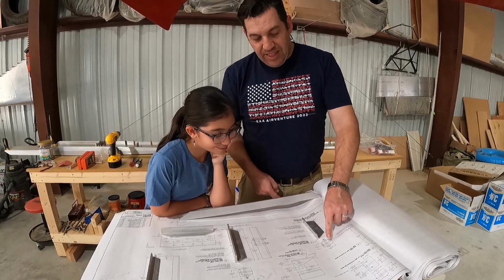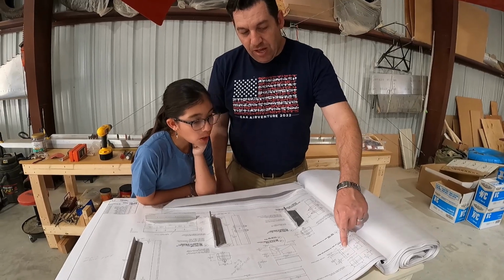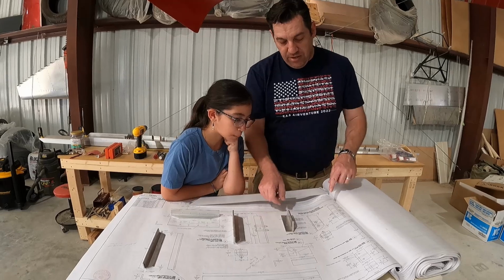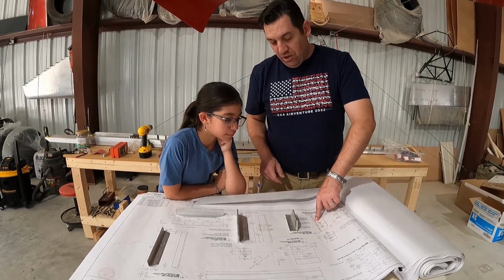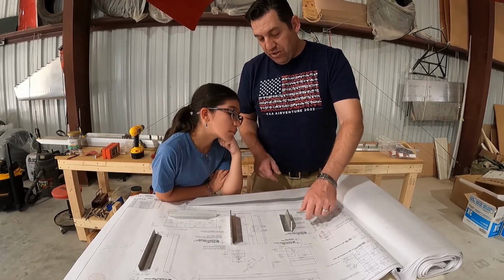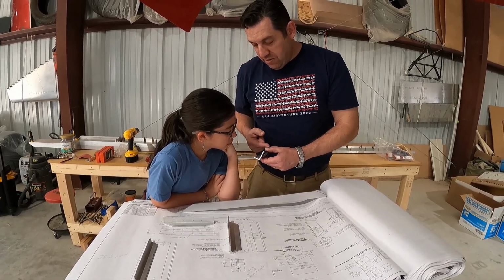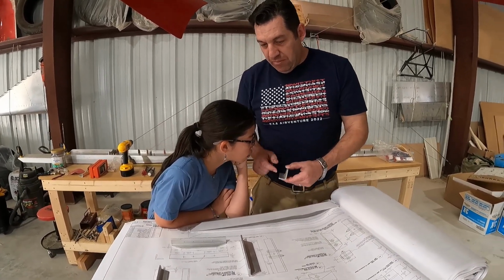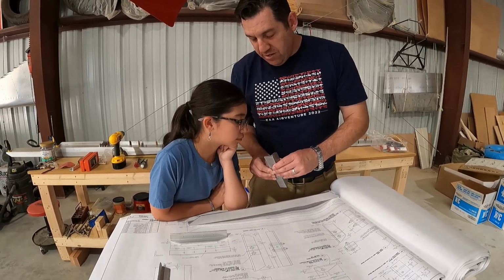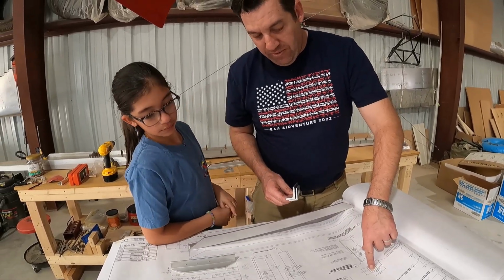What that means is we gotta make this piece as well, and here's the instructions up in the corner for how to make that block. And then there's an extra piece that we've already highlighted in yellow. It's called a shim. A shim is so it keeps it off of this curve in the metal. So if you look at the inside of that metal, you see how it's got the curve right there? If we put a square corner in that block like this, can we make that line up and keep everything touching? Nope.